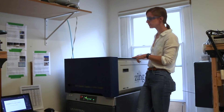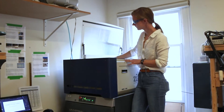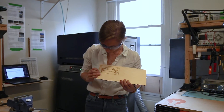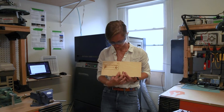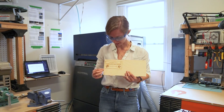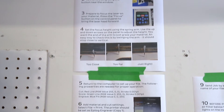Once it's all done, you'll see the laser go back into place, you can open it right up, and pull our material out. This didn't come out quite the way I wanted — we have our rastering, our scoring, and the path on the outside would have been a cut through. This material was a little bit warped so it didn't actually cut all the way through, so I might run it again just to get it to pop out. But it's very quick and straightforward — this cut job only took maybe two to three minutes.